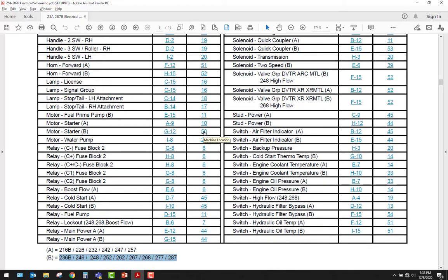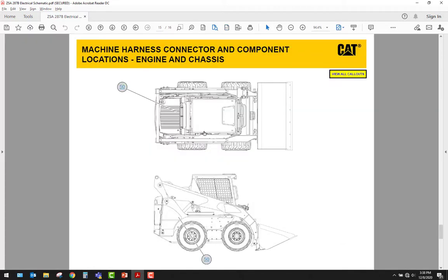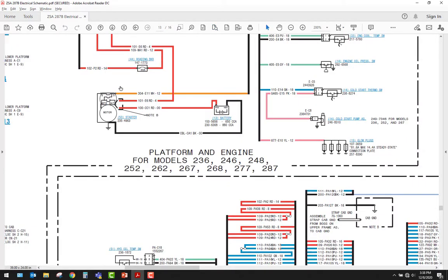Machine location is 50, so I'll click on 50 and it shows my starter motor is just above the rear wheel, looks like it's on the left-hand side of the machine — somewhere near the engine, which sounds right. I clicked on the location and it took me right there to the starter motor. It doesn't matter how the machine is set up; the biggest thing we need here is to be able to interpret a schematic, so I'm going to go through a few of the symbols.